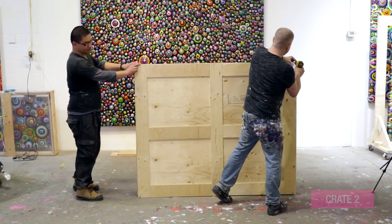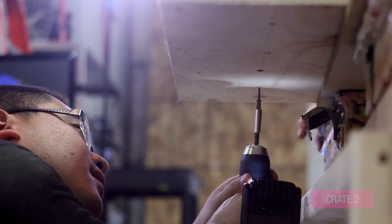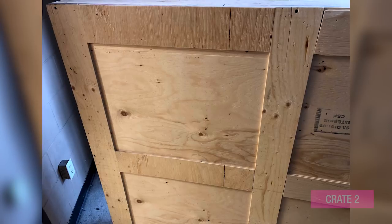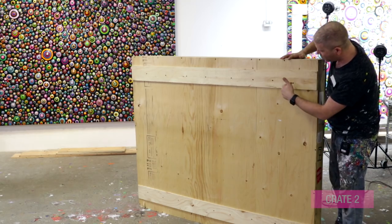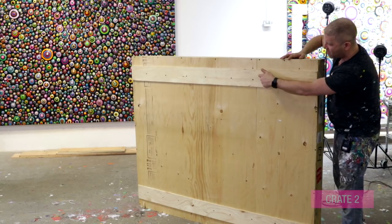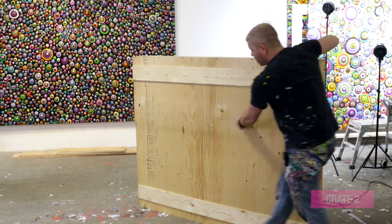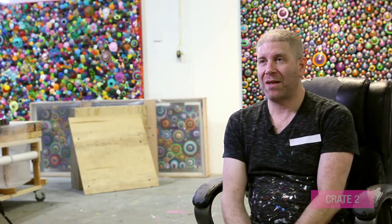Some people say, why don't you just put a piece of three-quarter-inch plywood across the whole top? That's going to add crazy amounts of weight and be very expensive. So usually you do a rectangle all the way around and then maybe a couple of pieces in the middle and a few small pieces — kind of a checkerboard pattern. Then attach that to the frame and put your bumpers on the painting — the three-quarter-inch ply — put the painting in and drill from behind. Make sure wherever you drill from behind there is the three-eighths-inch ply and strapping. You need about four more pieces vertically as well. Then the back goes on with strapping, the front goes on with strapping, and that's it. It's basically the same thing in a bigger crate.